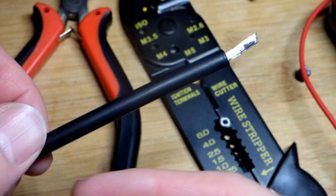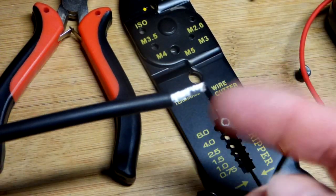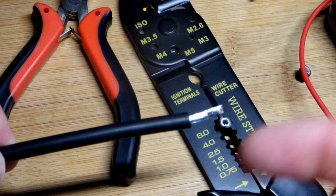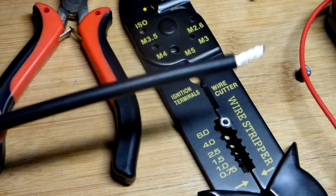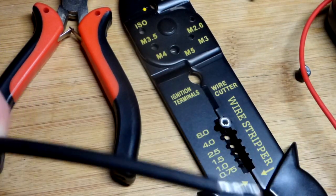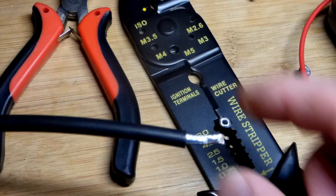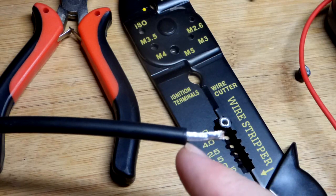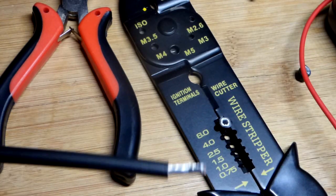So now we have, like I said, about 100 feet of cable that's really holding these strands in. Well, if it was only like this long or something, when you yank that insulation off, it's going to pull some of the strands forward. That's kind of inevitable. So I think you should strip one side, put a connector on there or something that holds the strands before you cut off more wire, and then put a connector on the other side. That is my opinion there. But yeah, this tool, we do have kind of a pinch right there where we took the first insulation off. So I think though it didn't damage the strands, just kind of pushed them together a little bit, maybe like that. These don't seem to flop away too easily.